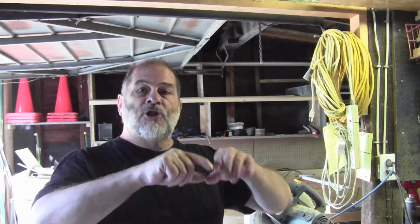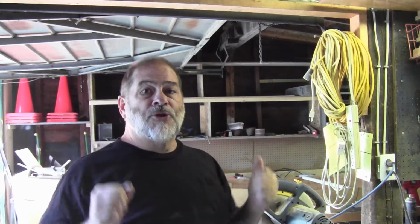So the first thing I'm thinking I need to do at this point is what they call the center thwart. There are other names for it depending on its shape, a yoke for example, but a yoke for a canoe is a shape that comes like this and has a curve in the center that can fit around your neck and be supported by your shoulders so you can carry the canoe in portage. I will never portage this canoe, so I'm not making a yoke. So I'm going to make a thwart, which is slightly different.